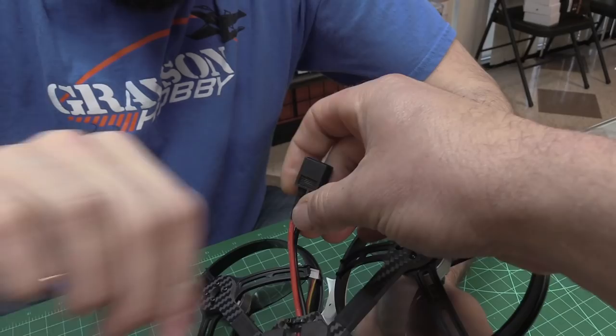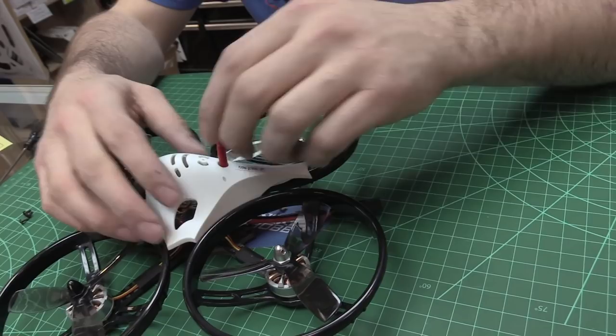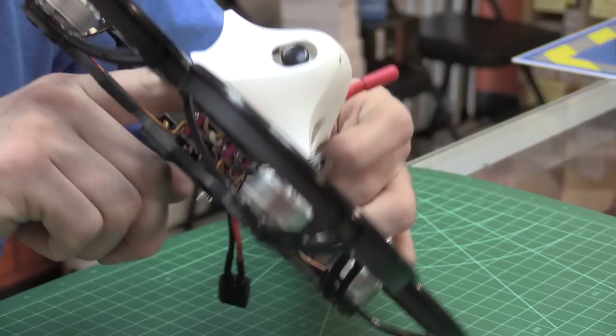AMASS was the company that originally designed the XT60, so it's the genuine connector — high heat nylon, not going to warp, with good bullet connectors. One thing I'd like to see is a slightly longer cable for the camera; otherwise you have to unbolt the camera from the top without stretching the wire because it's kind of tight. Make sure you unplug the cable first.